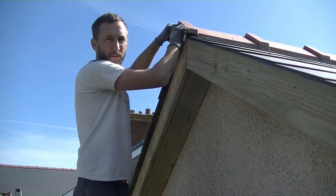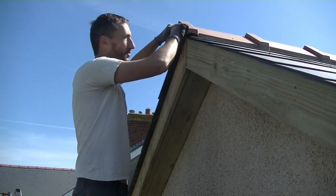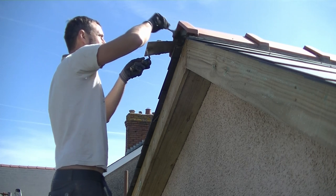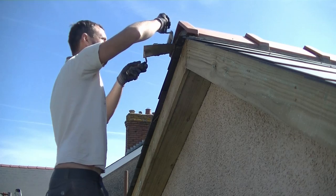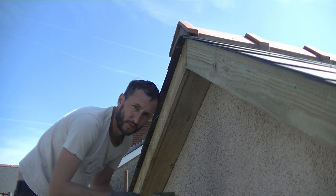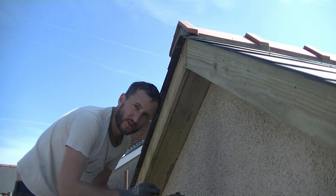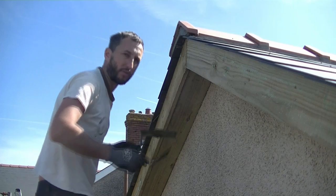All I'm doing here is just using a little bit of broken slate just to fill the gap underneath so the mortar doesn't fall through. In case any of you missed it, I'm using the same mix I've done on all the ridge tiles, which is one sharp sand, two builder's sand, to one cement, and then a tiny little bit of plasticiser - just a tiny drop - mix it in a bucket and that's good to go. That's a nice rigid mix for this sort of work.